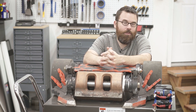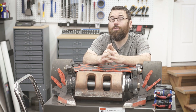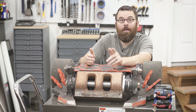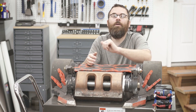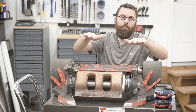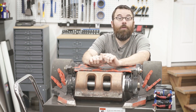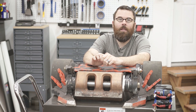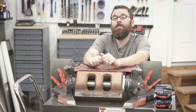And that's essentially what a soft start circuit does — it basically slows down that flow of electricity initially, lets everything gradually come up to the right voltage, and then you can turn everything on safely. So let's go over to some things I have set up and I'll show you what that pop looks like, and then I can show you what it does to connectors.